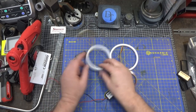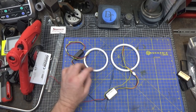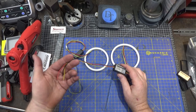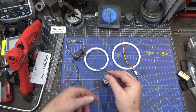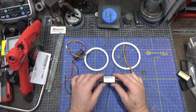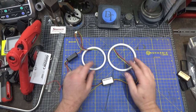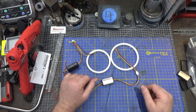They're LEDs — also dual color, which I don't need — with amber LEDs and white LEDs going around the ring. They come with a constant current supply, so you feed them between 9 and 36 volts on the input. Black is common, red is the white light, yellow is the amber light on this particular model. Each one has a constant current driver designed for the specific group of LEDs. They come in pairs, so I ended up with four of these — I only needed two, but it gives me an opportunity to try out making a ring light.